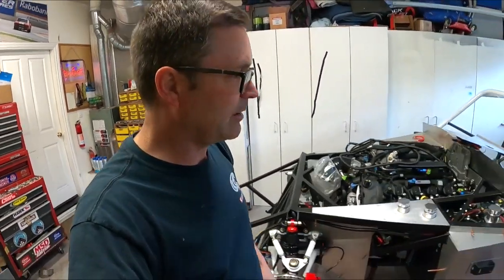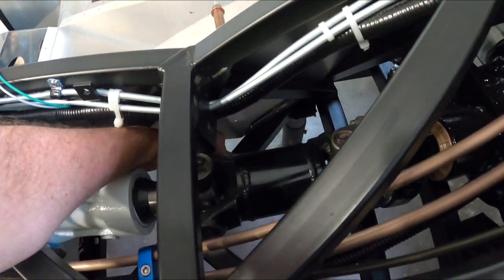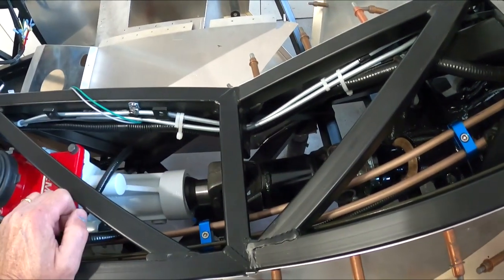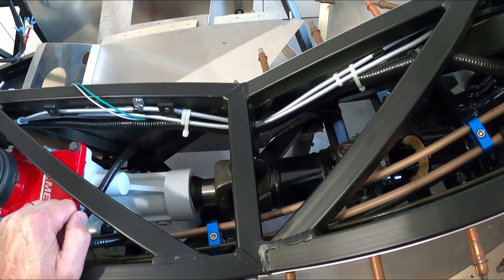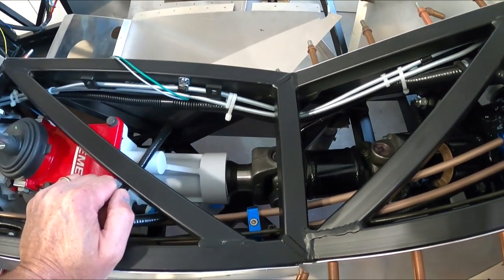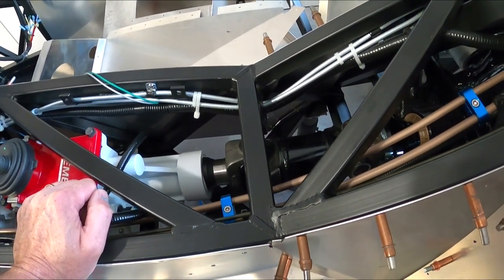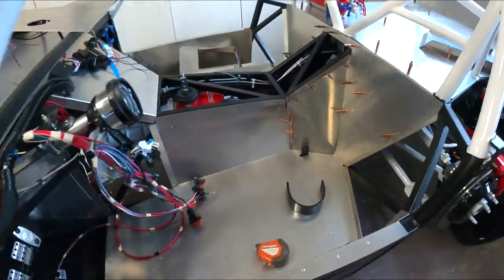I'm going to run a safety loop just because you're sitting so close to the driveshaft. If it were back toward the rear of the car, I wouldn't bother — it's not going to pole-vault this car. But being right next to you, I'm running one. I bought a generic unit from Summit Racing; you can bolt them in to the top of the rail, but I'm actually going to weld it in. I don't want to drill big holes through that square tubing. Hit subscribe if you want to see more.